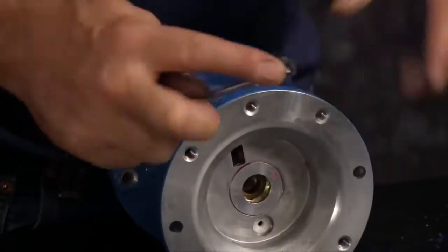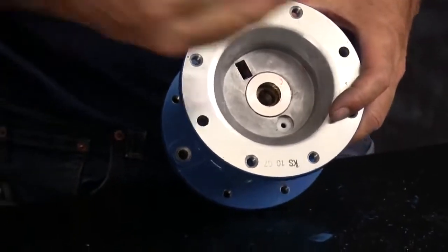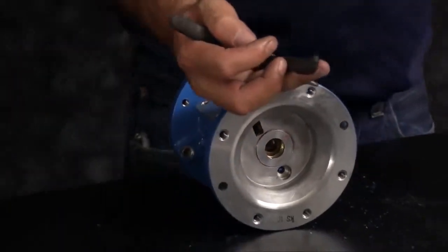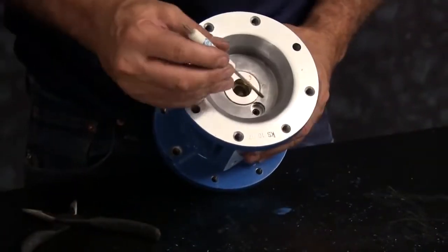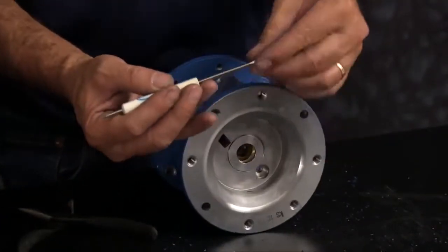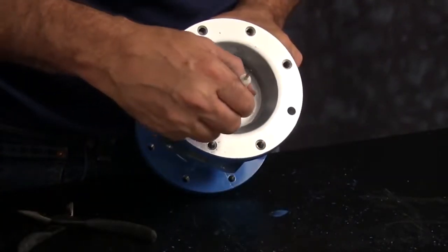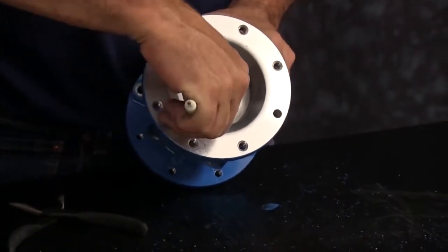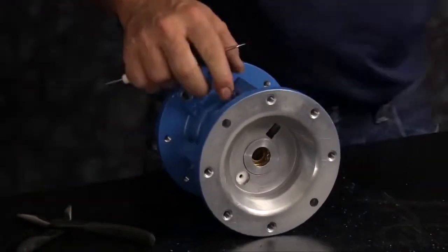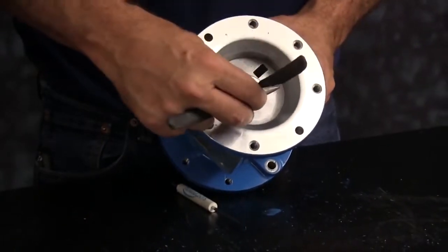And then the bushing. You may need something to wedge into the bushing. Here we're using a pair of needle nose pliers. A small wood screw will also work. And then the actuator plunger O-ring. You want to repeat this for the opposite side. Remove the star ring, the actuator plunger, and the O-ring, and you can discard all those components.